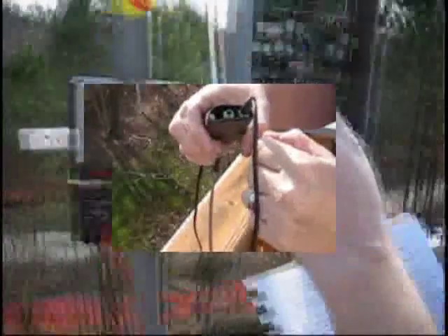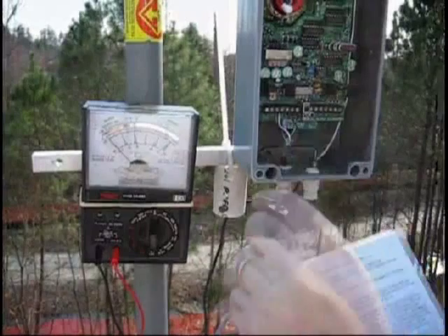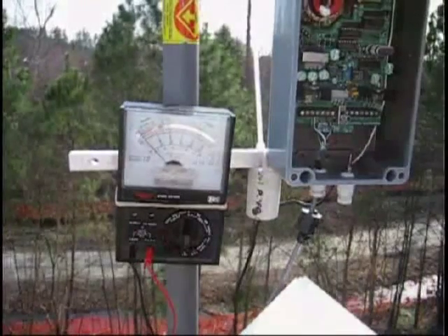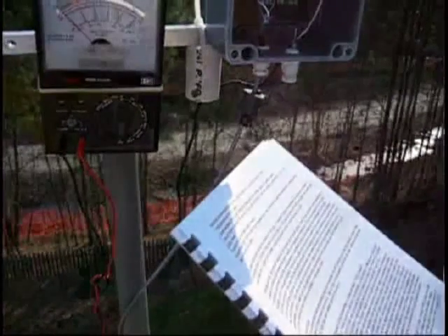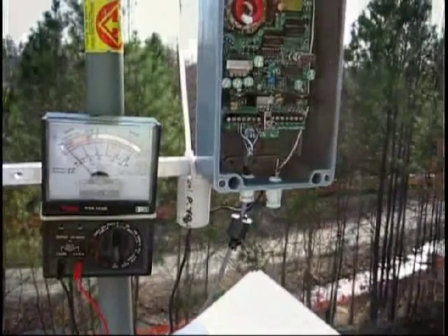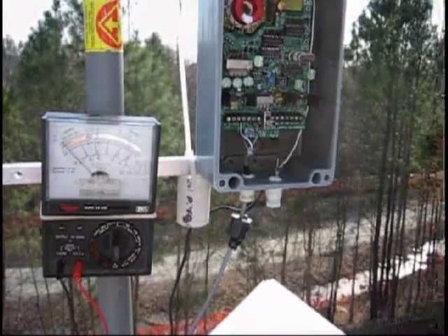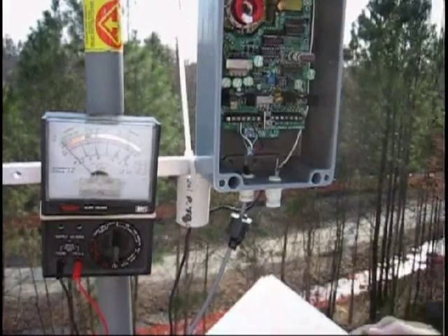If you're having trouble, check the voltage on the power input terminals — make sure you've got at least 14 volts there. Low range can often be a bad ground; it could just be bad soil conductivity in your area. That won't cause severe problems — it will cause you to have average or poor range instead of good range. Or maybe the ground rod is just in gravel or sand instead of dirt. If you could just push your ground rod into the ground, that's a bad sign. Good dirt is like good farming dirt — not all sand or all clay, somewhere in between.